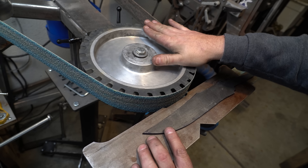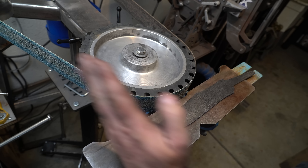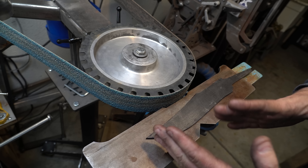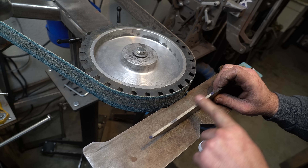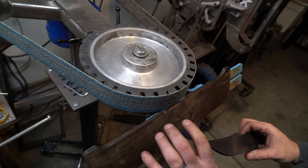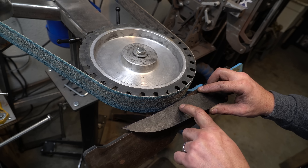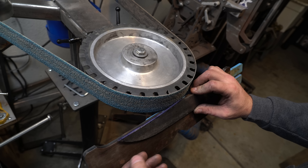You'll notice I have my grinder in the horizontal position. If you don't have a grinder that goes horizontal, make a rest that lets you orient it the same way. You are going to need either a rest that tilts or some kind of jig where you can angle the blade. The very first thing we're going to do is put our scribe line — apply some layout fluid and mark a center line. The angle itself isn't critical; about 60 degrees is good. The more angle, the longer the bevel will be on your false edge, so just try it once and if it's not enough, drop the angle down a bit.